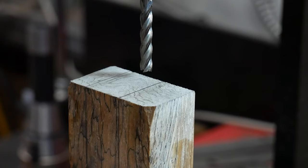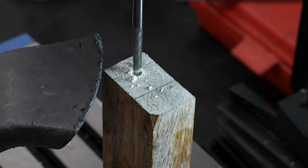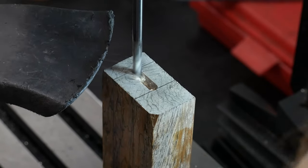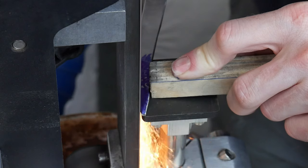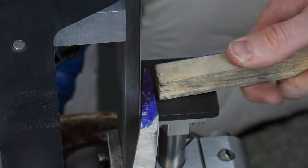The first thing I do with a block like this is to get all four sides nice and square in the mill, then I can get on to milling my slot through the block. I found an extra-long 3/16, 7-inch end mill to put in my slot, which makes this process way easier than the drill-out-and-broach method.